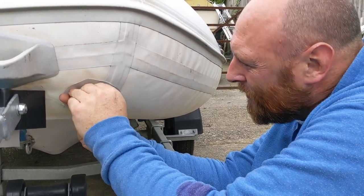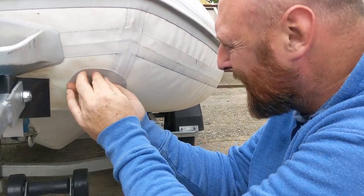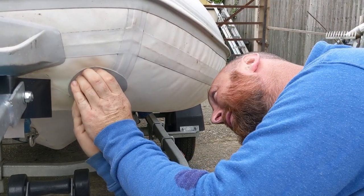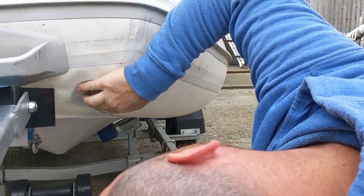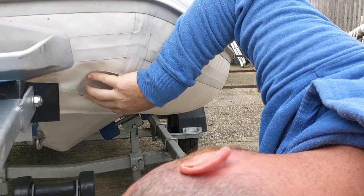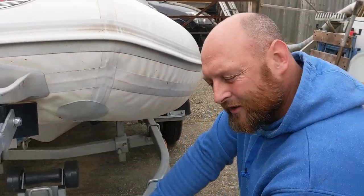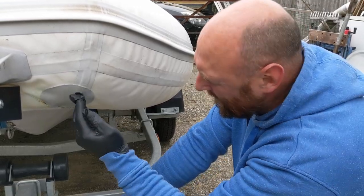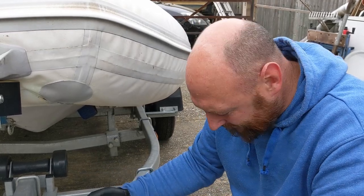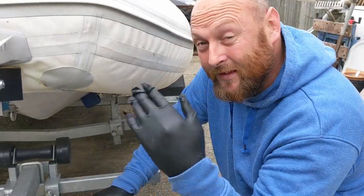If your patch is in a really non-visible place where you don't mind it looking a bit messy, once it's set you could go around the edges with some adhesive and smear it in. But it will yellow, it'll look ugly. So if it's on a part of the RIB you can see, you won't want that. One thing I forgot to mention is that you should be wearing gloves when using the glue. I went and got my gloves on as soon as I needed to touch the patch — these are just disposable latex gloves. Anything you've got will work fine, just to keep the glue off you. It's toxic and obviously really sticky, and once it's on your hand it's really hard to get off. Wear gloves.